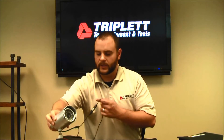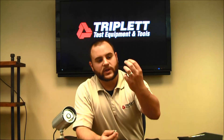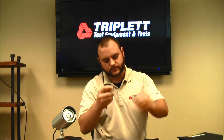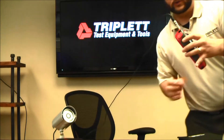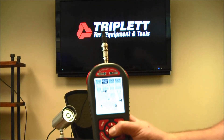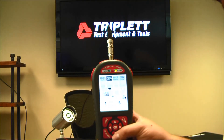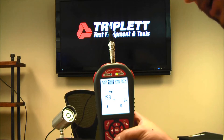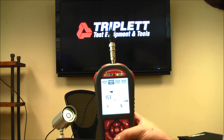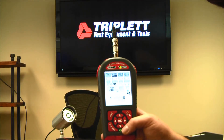I have a small analog camera and a BNC cable. Many know that you need 1.1 volts coming across the BNC cable line for a camera to work properly and for a DVR to start recording. I use one of the BNC adapters that comes with the LV Pro kit, screw it in at the top, press OK, and it measures 1.66 volts coming across — indicating this camera is working properly. If a camera weren't working, you'd see it under 1 volt or nothing at all, indicating a problem with the power supply or camera.